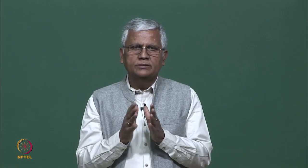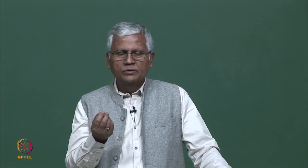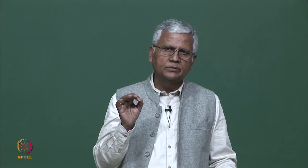So, what we have discussed, if we summarize: the heart of the spinning system is the twisting or wrapping unit. This wrapping unit has a very intelligent design. The vortex has to be generated, there are jets, then there is a spindle which is also hollow, and there is an entry of fibers. So, if we look at each and every part of the design aspect, it is very complex and a very intelligent design.